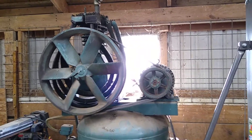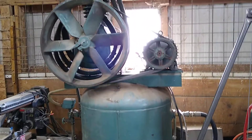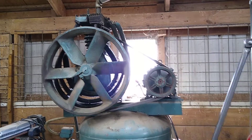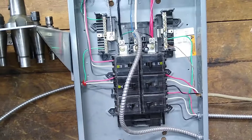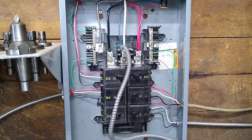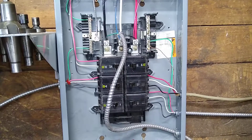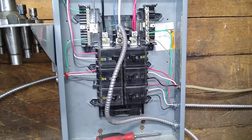The 12 horsepower Kellogg 3-phase 120 gallon air compressor tank is a problem — I don't have a breaker that's large enough for this panel. It trips the 30 amp breaker when I try to start it, partly because the wire is too small. It only pulls 25 amps when running, but startup is about 125 amps.